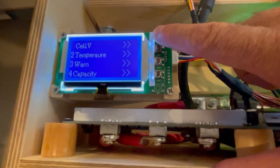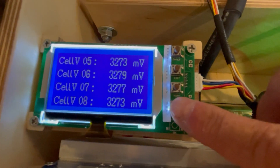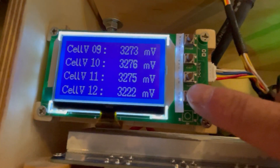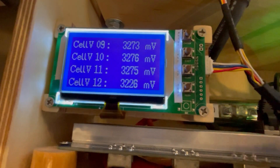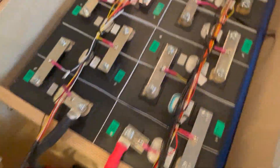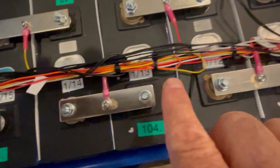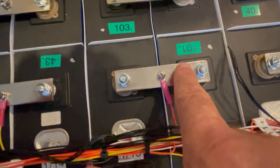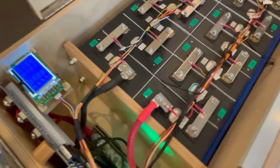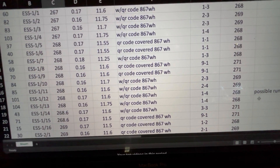When I go look at cell voltages, they look really even — not bad at all — until you get to cell number 12. I've got a runner: that one is 50 millivolts lower than the others. All the other cells are equal except for cell number 12. This is battery pack 1, cell 16 over here, and battery pack 1, cell 12 over there — and that corresponds to unique cell number 101 from when I first received them.